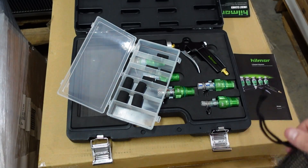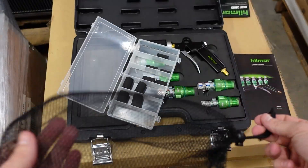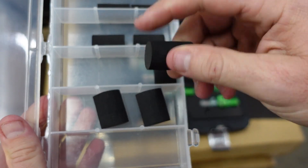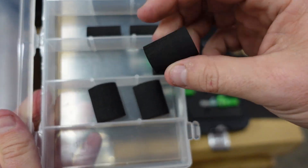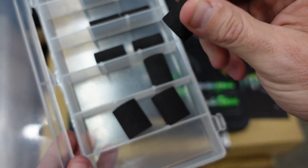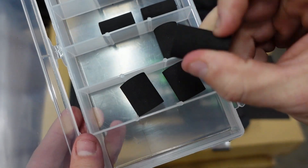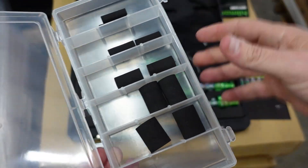It's also a nice thing to do because you can see what was actually in the lines more easily, which gives you a sense of the internal condition. I also want to show the manufacturing on these plugs — it's very consistent. You'll find some other brands where the manufacturing has little burrs or pieces that can come off. We don't want to leave any pieces inside the system, so having firm plugs that can still flex but are manufactured very smooth is advantageous — they don't leave anything in the lines and also last longer.